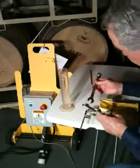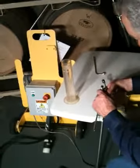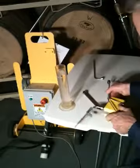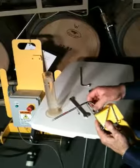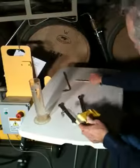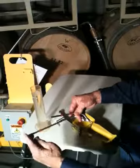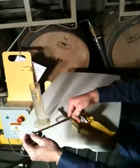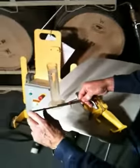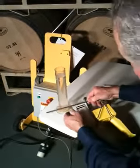This is a 5/8 inch wrench for backup, and this is a 9/16 inch wrench. You just put it on here and crack it loose. Take it off with your fingers. And there it is. Now this is a longer sensor tube. I want to show that all it does is lower the cutoff point by approximately 2 inches. So we've put in a sensor that's approximately 4 inches longer, and it shifted the shutoff point about 2 inches down.